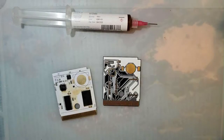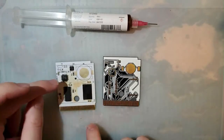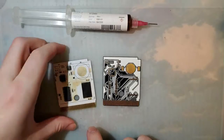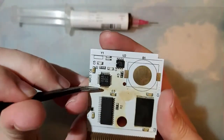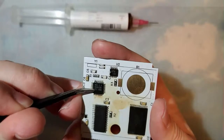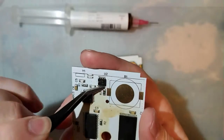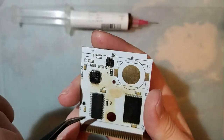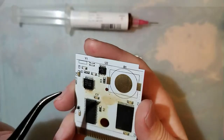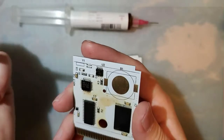Okay, so I want to go ahead and transfer over these four components right here. I want to transfer over the MBC3 chip, the memory banking chip. I want to transfer over the power management chip, which really doesn't do much when you have a FRAM module installed, but without it, the real-time clock will not work, so we need it for that. And then I'm going to transfer over my FRAM module.